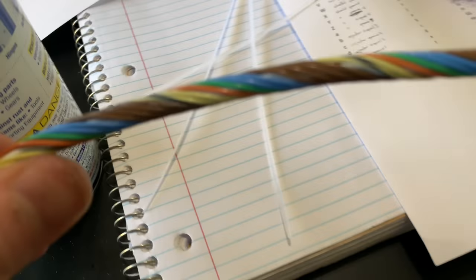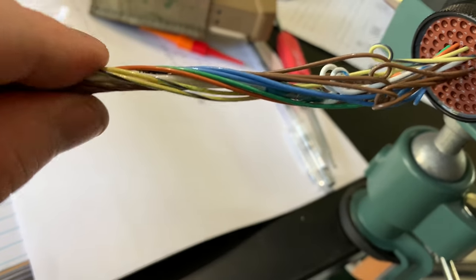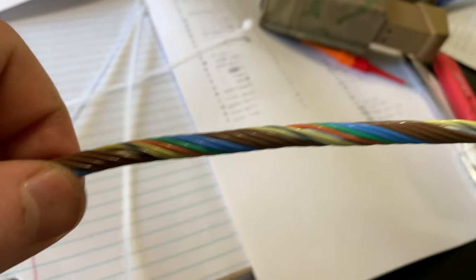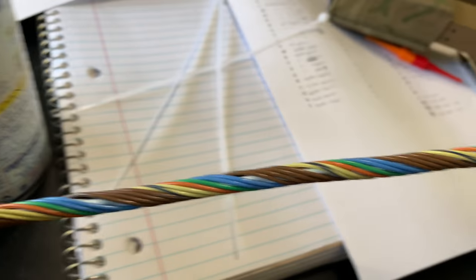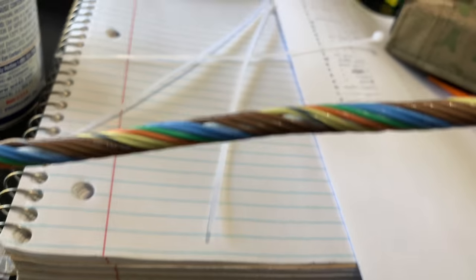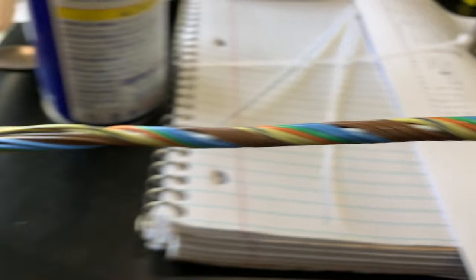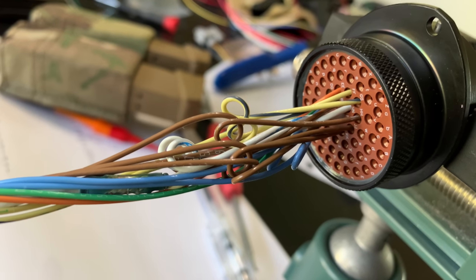As you can see, there's a little bit of a gap here. This is the transition, where we'll want to pull those a little tighter. But yeah, there are some gaps, so this layer needs more wires. Right now it has 10 wires in it. I wasn't quite sure how many this required to wrap over this cable here, but it looks like a few more, maybe 11 or 12. So we will add a couple wires to this autosport connector and get those wrapped up here.